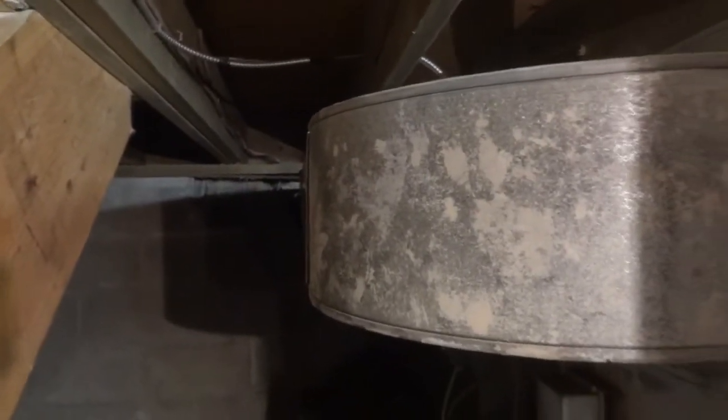So yeah, we're changing all this. This is coming out of here, just this duct, the duct itself, just the way they did it, to come off, you know, here, which is a supply to the other side of the house. They knocked a hole through the wall and put another, and that's not bad. At least they gave it the 45 here. You got your swoop, right? Same with this, but this 45s, okay, actually 90s, and then you 90 again.